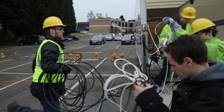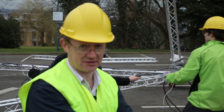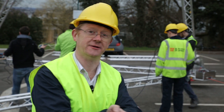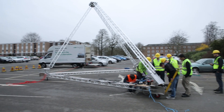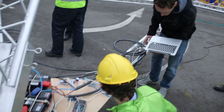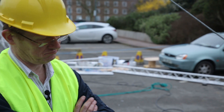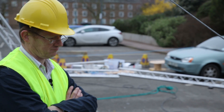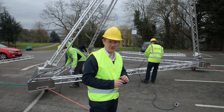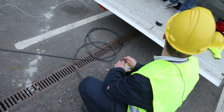This is an automatic control system. Ordinarily on a wind turbine there's a sensor which tells you which direction the wind is coming from, and the yaw system points the turbine towards the wind. We're using an Arduino, which is a small controller, and an IMU — inertial measurement unit — which has a sensor that knows where the Earth's magnetic field is. It's going to try and adjust itself to be at the right angle, pulling one winch and letting out the other. Stand clear — just let it do its thing.